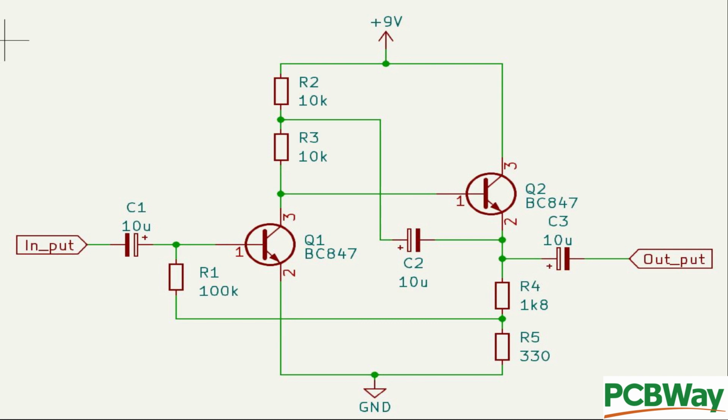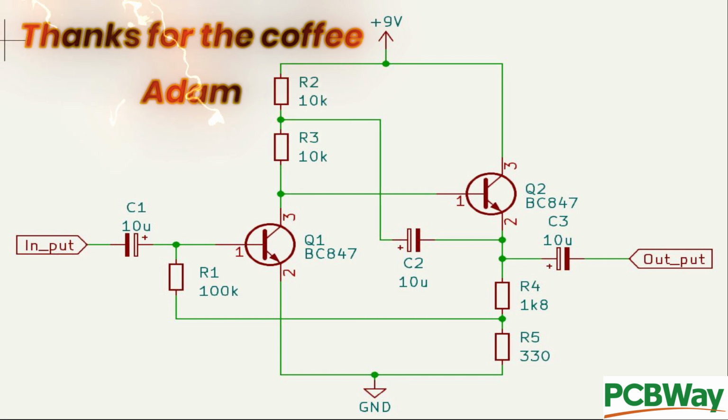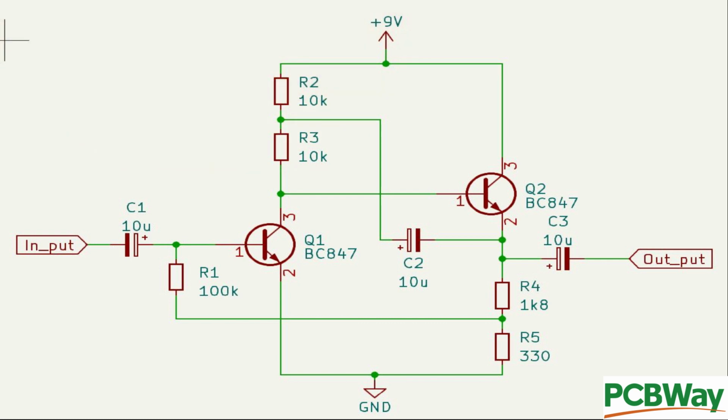Well, looking at this circuit, you may ask, where did I start, or how did I start? Some of the values are not optimised for the best circuit design or best gain, but they're the ones in my kit, so I've used them. We'll be looking at very low level input signals. There will not be a great input voltage swing on the base of Q1, so we can bias it around its turn-on voltage, so we haven't really got to worry about where it sits.